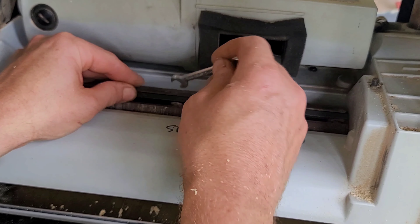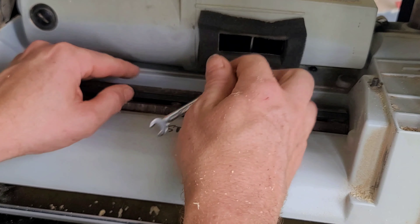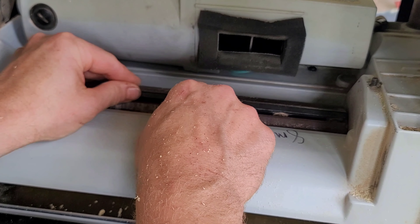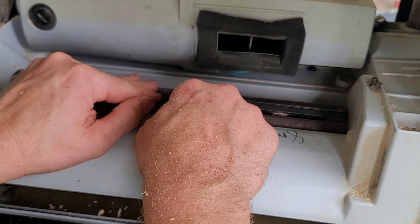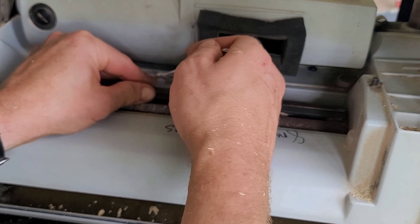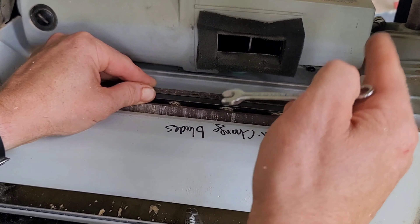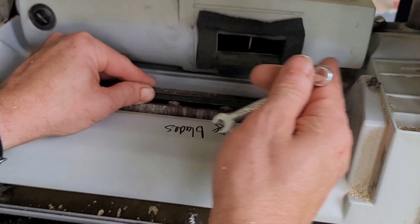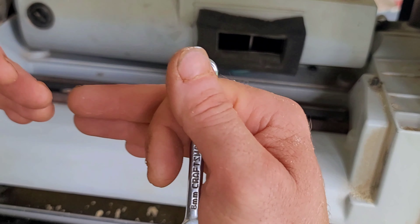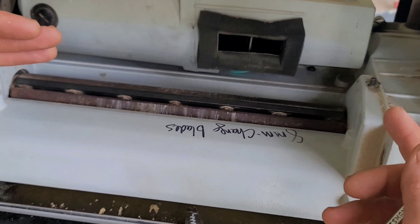I'm going to start at the middle — make sure it's right on both sides. Work to the middle and out. It's like you do with an oak, anything you try to get the bow out of — you work through the middle and out. You don't want to start on both ends and come inward because it'll have a warp in it and you can't get it out. So you start in the middle and work out.